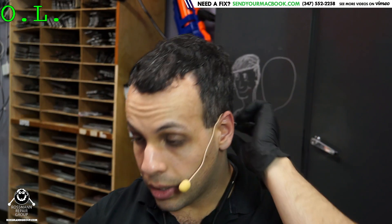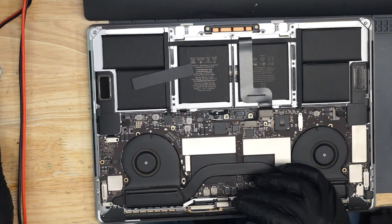There is a guide in the document linked below that tells you if you're not getting a power rail, why it might be missing. It could be: one, the enable signal is not present on the chip — like a light switch off; two, the chip itself is bad; three, the rail is being created but shorted to ground; or four, the input voltage to the chip is missing. If you don't have the in, you don't have the out. Here, case three is true — we have a short circuit to ground at sixteen ohms. So we're going to take this board out and find the short on PPBus G3 hot.